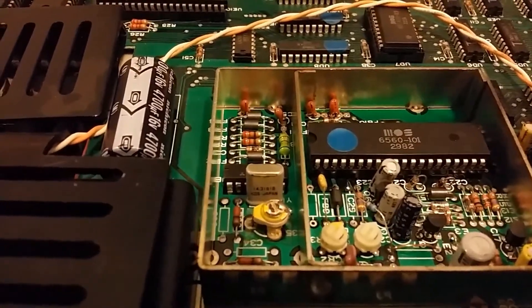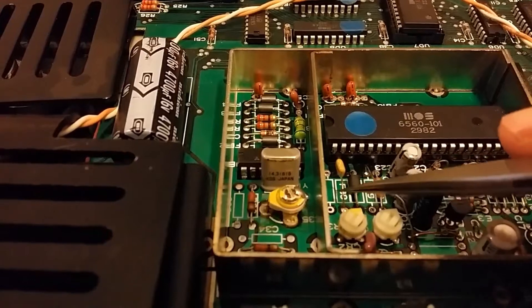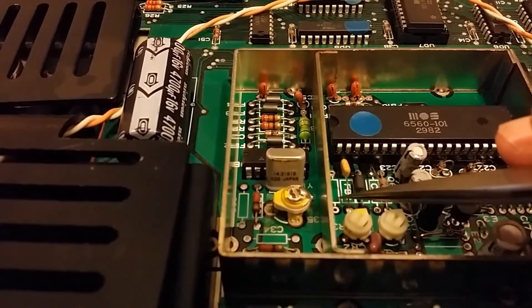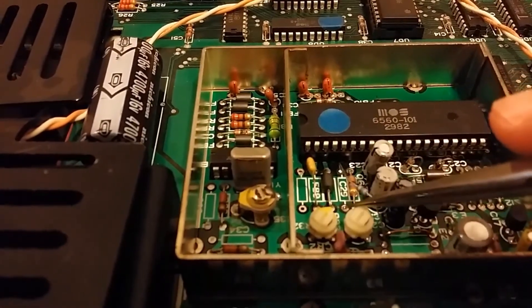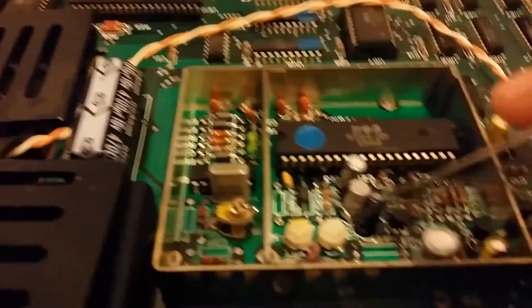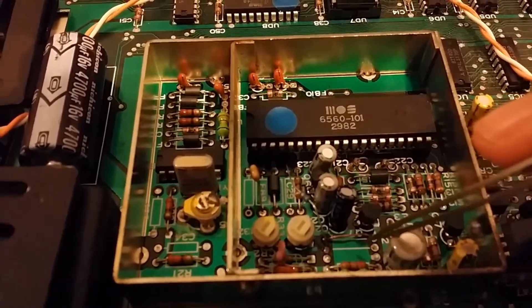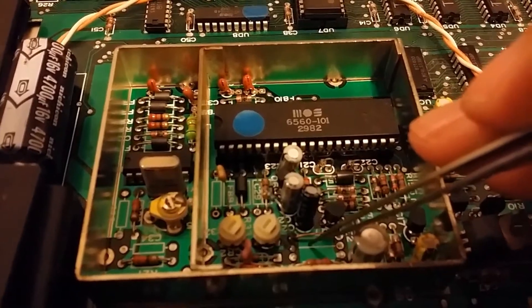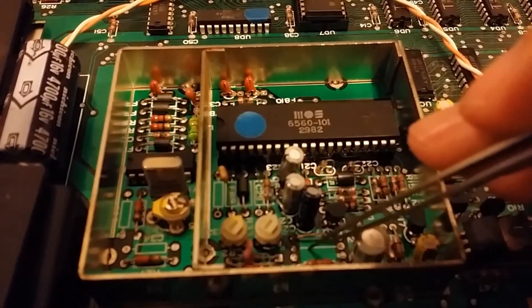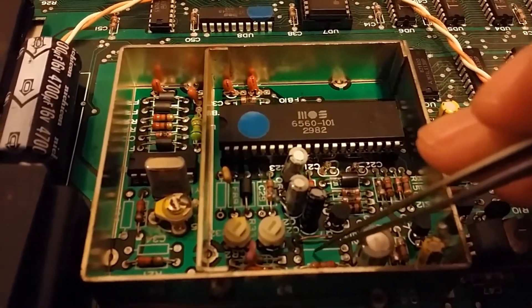I have finished the mod here. I started by pulling out four components. First one I pulled out was FB9 over here, a little inductor. Right next to it is a small capacitor that goes straight to ground - I decided to pull that one out as well. After I pulled that out I also pulled out C-29 right here. And a small inductor that went from here to here, right across. Pulling that inductor out severs the connection between pin 4 and pin 5, which would have in effect made them the same signal.